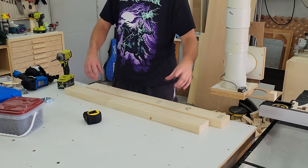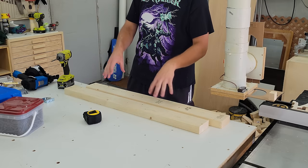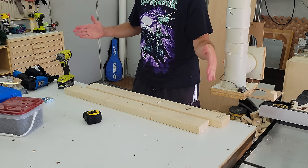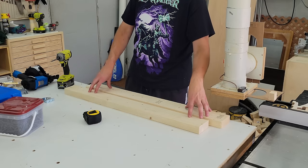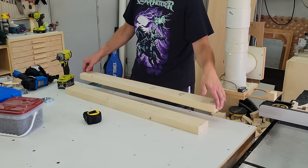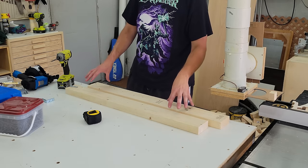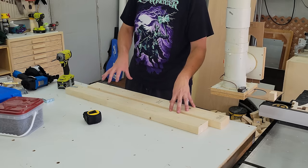So I've gone ahead and set up the rafters temporarily outside from the edges to where the peak is going to be. I used a little block of wood, the exact thickness, the 5.5 inches of that 2x6 beam that's going to run down the middle. And I got my measurement to the bottom, which thankfully actually matched my plans. You always want to take real world dimensions and not 100% trust the plans. So we've got these two pieces that are going to support that 2x6 beam. And now I'm just going to simply attach some L brackets to the bottom. This will temporarily hold everything in place while we get that 2x6 set on top, and then we can start attaching our rafters to the 2x6 beam.